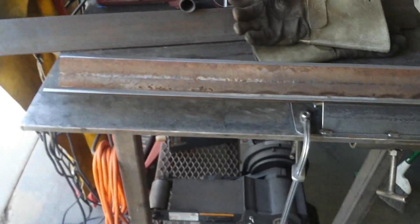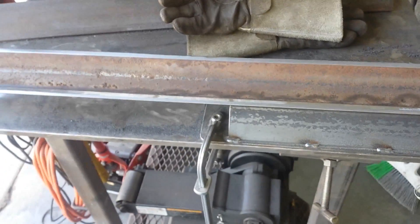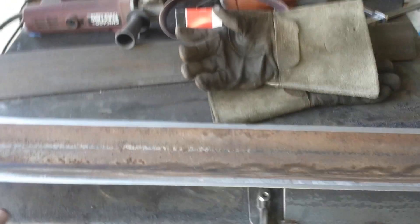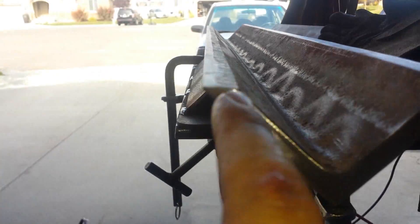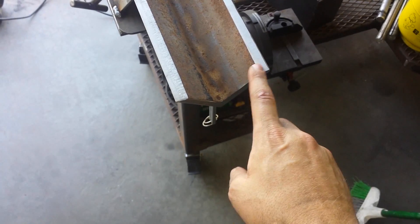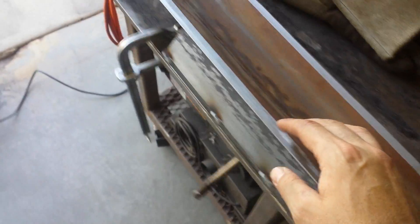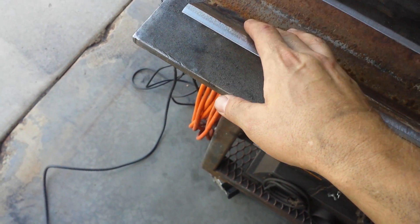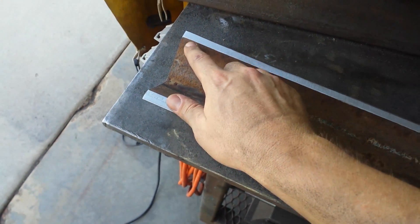I'm in the process of making a bending brake, about three feet long. In order to get sharper bends on the material, I've been flattening one edge of this angle iron — it's still hot, it's three-eighths of an inch thick by about three inches. You can see I've flattened that edge out. I didn't worry about the backside too much; I just really need one good edge, so I concentrated on getting the material down on this. I've had to grind on it for what seems like an hour or maybe even longer.